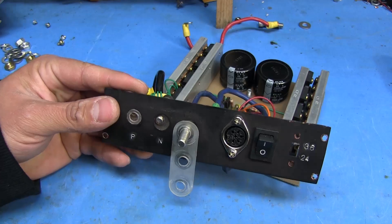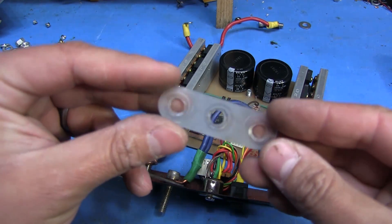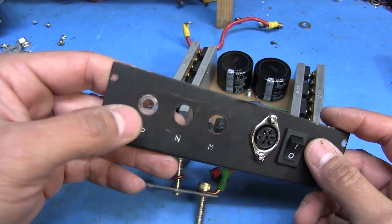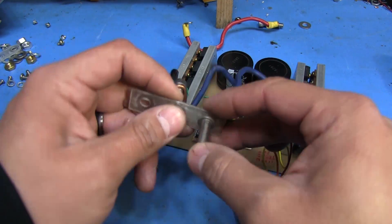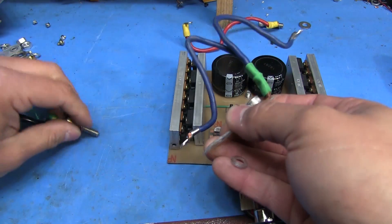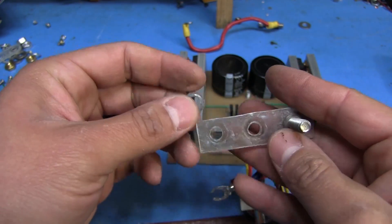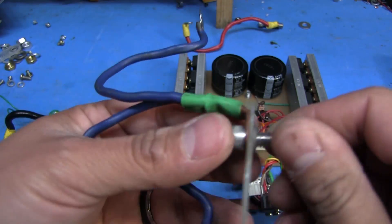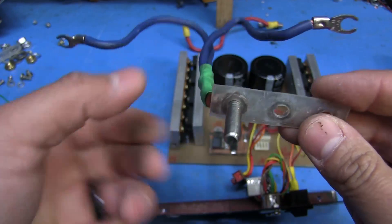To keep it all insulated from touching the metal - this is actually stuck on really well now from being in there so long. That was a little bit more of a pain to remove than I was hoping. So this piece in the front is just a little piece of acrylic I cut out and drilled holes into - that's to insulate the front. To insulate in the middle I cut out - actually I punched them out - also out of acrylic, these sort of little insulating rings. There's one in there; the other ones stayed on here. They were supposed to be glued onto this back piece but they fell off. Just pressure's been keeping them there over time. That's what keeps these insulated from the rest of the case.